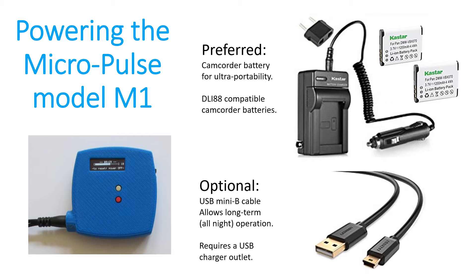The reason that I use a USB mini-B is because it's a very strong physical connector. Even though it's not the latest USB connector and it's not the smallest USB connector, it is the physically strongest USB connector. So by using the USB mini-B, you're a lot less likely to have to send the device in for warranty repairs.